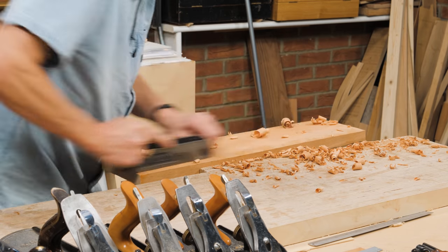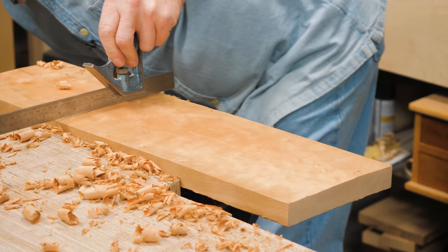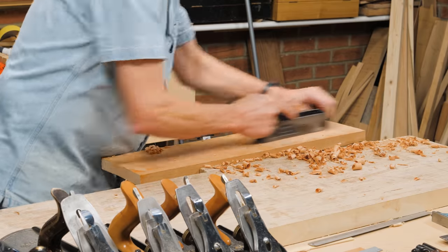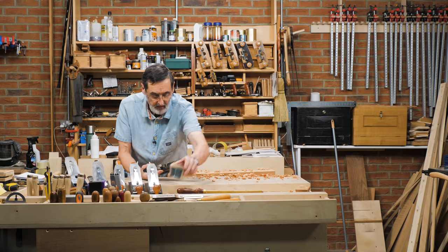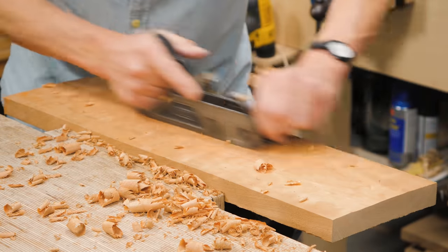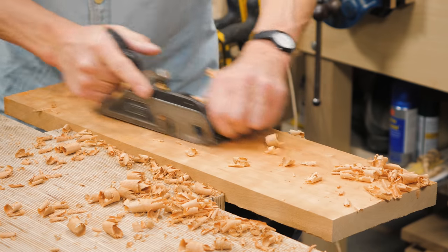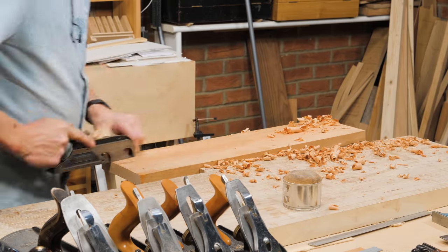At some point I take a straight edge — just like your square — and look across the board. Of course I've still got bags of undulation in there from this plane, but I'm taking the midsection down, working across the width, taking that high bit down. I put a little bit of oil on the sole — this is my rag-in-a-can oiler — and all of a sudden I've got these long strokes taking it down. I'm really happy with that because I've gotten rid of all the sawing marks from the bandsaw and circular saw.